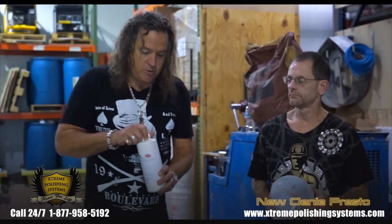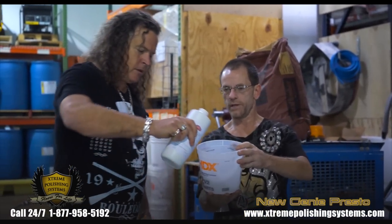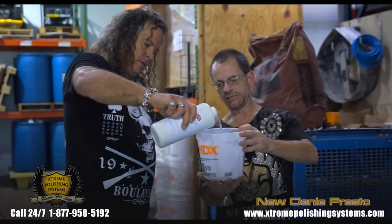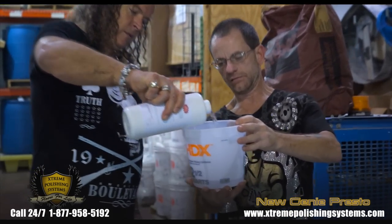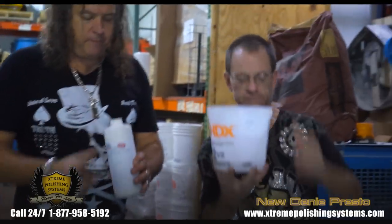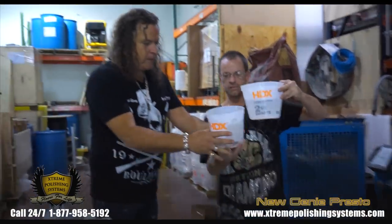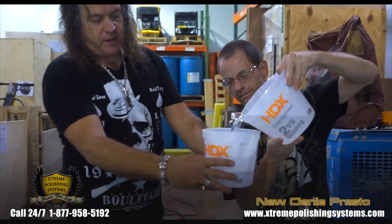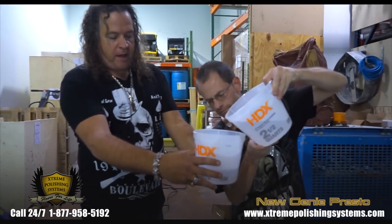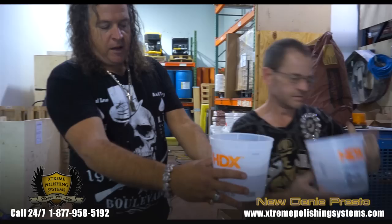So what we're going to do is take part of this and fill it up. 4-to-1 mix. So you make sure you have 4 parts water to every part of densifier. The densifier is concentrated. We make it that way for a reason. Why do we have concentrated products? So you don't have to pay for all the shipment.